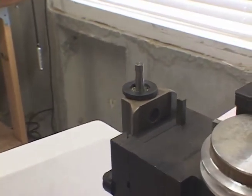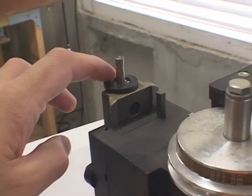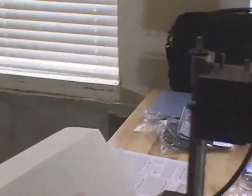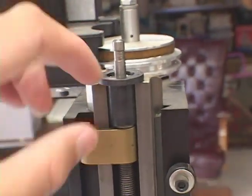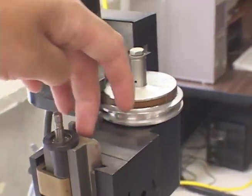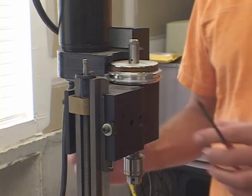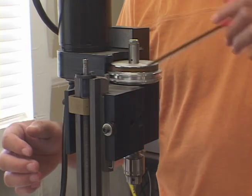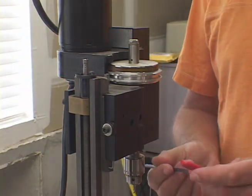The z-axis thrust right here is held in differently. Instead of having a little screw on the side like the other two, the table has a little allen head right here. It's got a longer collar to it, so it's held in from the back side. To access it, I'm going to either get a ball-head allen wrench or take this part off, which is going to come off anyway. So we're going to remove the headstock to gain access to this allen screw and then take off this thrust bearing or washer. This is a 5/32-inch allen wrench.